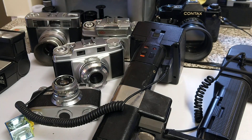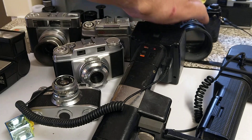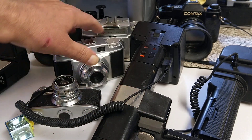I tend to use modern dedicated flashes specific to the camera — with my Nikons and Canon DSLRs — because I don't want to fry the camera. Old film flashes on old film cameras are not a worry. I do have a video about the Vivitar 283, which is a common and very popular flash gun. There are two versions: one is a high-voltage version which will wreck a modern camera, and the other is a lower-voltage version which is fine to use on everything. The low-voltage guns are also safe to use with old cameras.